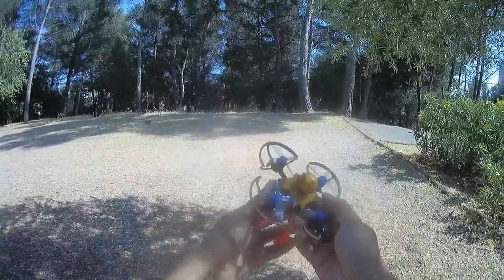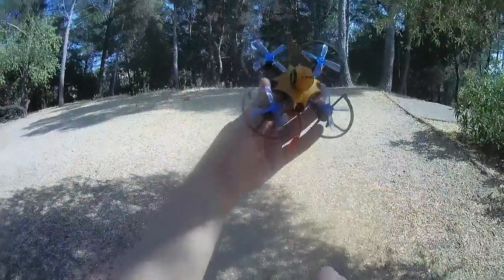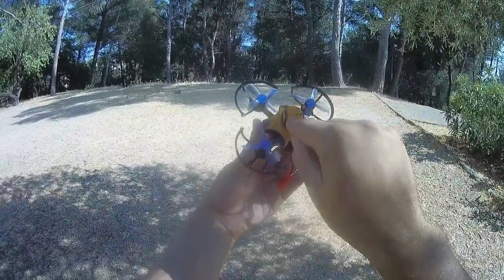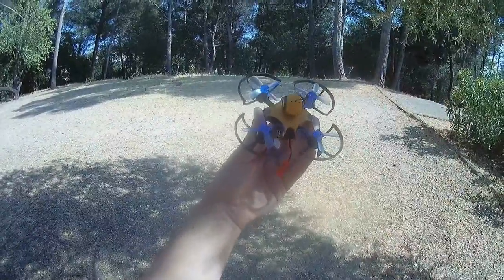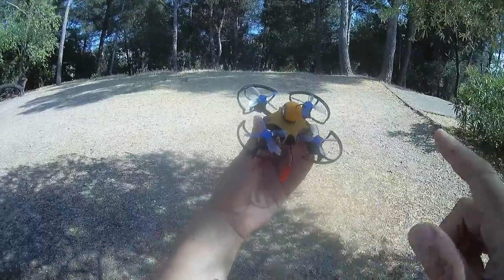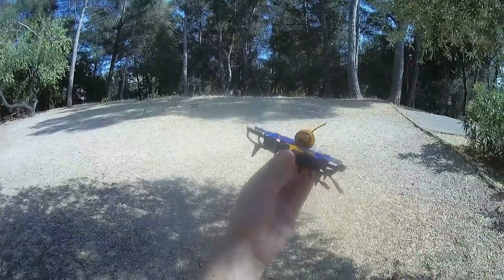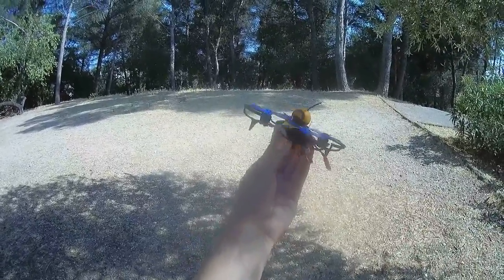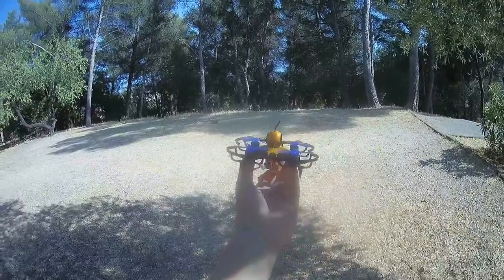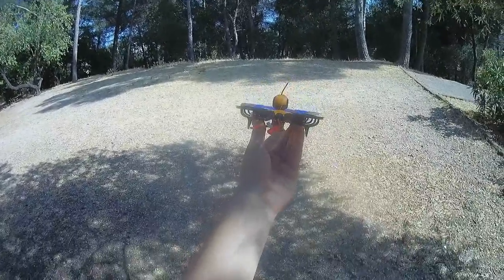And about the FPV camera, I forgot to mention, like the F90, how to tune the frequency. You have this left hole where you have to insert a very small screwdriver. Short press, you will cycle between the 8 frequencies inside the currently selected band, and if you long press, you will cycle between the 5 supported bands. Okay, race band is supported, so it's exactly the same as the first Octopus F90, nothing more. So I will start to fly in LOS to show you how punchy this machine is, and then continue more in FPV. Let's go.